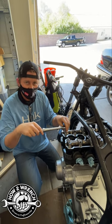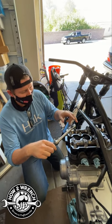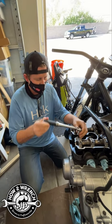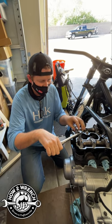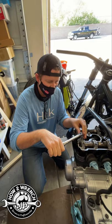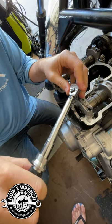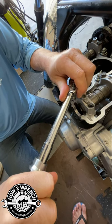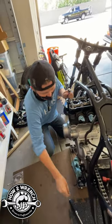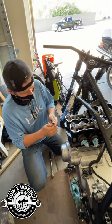If this were truly a fastener problem, you'd probably get to that 50 and this one's going 'whoa, something isn't right.' There's a chance you'd catch it — maybe not, but it's a good start. Then do all of them, and raise it to 96. I want you to really look at my technique — this is the big thing. Support the tool so it can't slip. Hold the handle exactly where you need to, and when you're at this point, I'm not looking at the bolt or my hand — I'm looking right at the pivot point for that little articulation of the clicker. When possible, don't use a torque wrench to loosen fasteners — use ratchets.